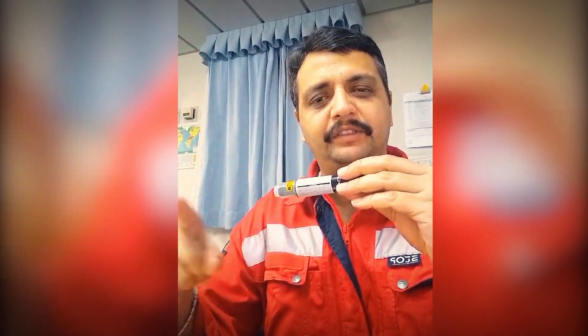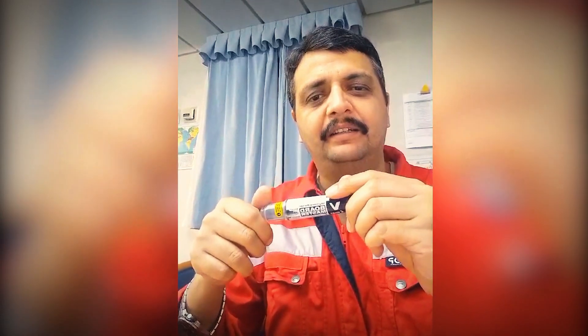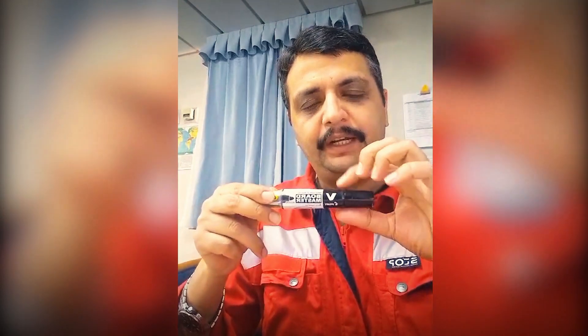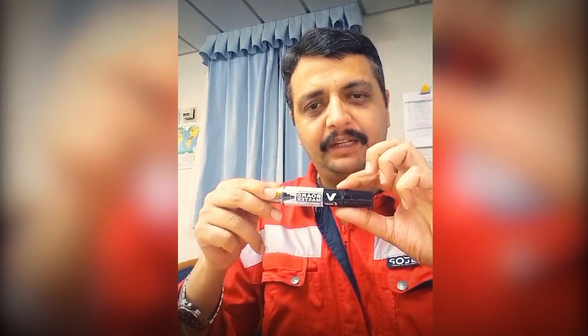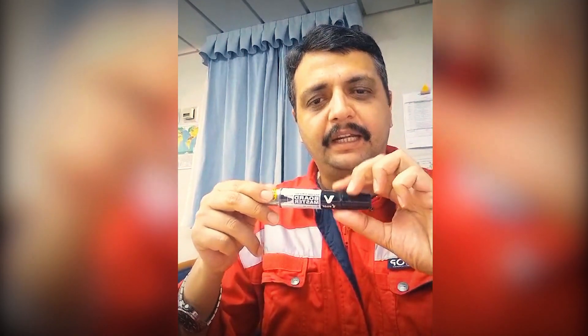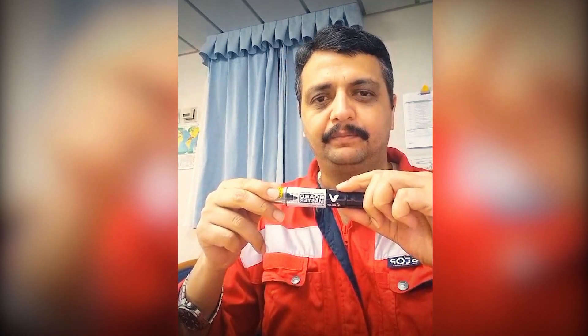Up till this point, the wire is safe, and if there is more tension on the wire, the winch will give slack and the wire will be safe. So this is a very important point: whenever we do the brake test according to the manual book, we note this limit and make a marking. Every mooring operation, we tighten the brake up till that marking only. Thank you.